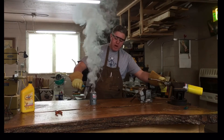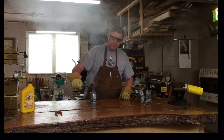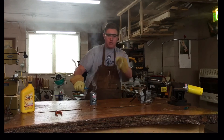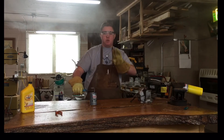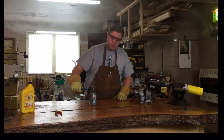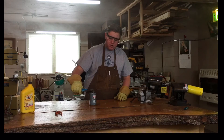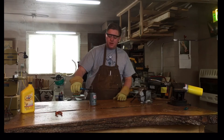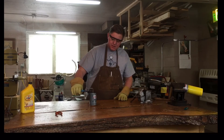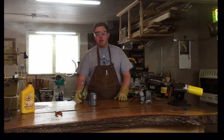You're going to want to swish it around in the oil. If it were a blade, you'd want to cut through the oil lengthwise, to prevent warping — going sideways could cause the metal to warp. Let it cool in there for a little bit; I don't really know an exact time. Man, this stuff is everywhere — that's nasty. You probably should not breathe that in; wear a mask when you do this. Alright, that's it for the heat treating process.